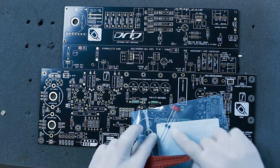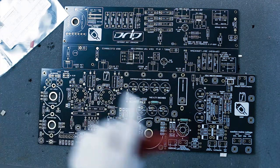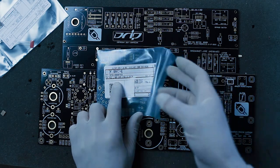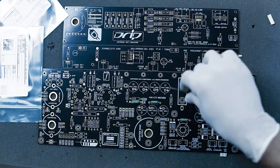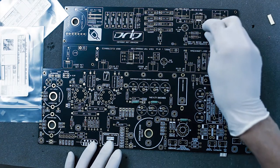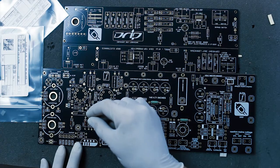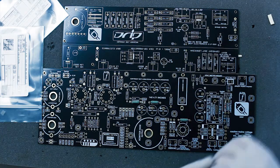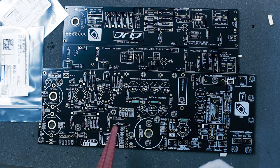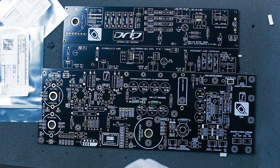I got the diodes but I'm going to use a 6x4 tube. Next item is a 1 meg ohm resistor — we have three 1 meg resistors. One's in the filter, one's in the bottom board, one's R7. The third 1M resistor is right here next to the output transformer — that's a 1-inch lead spread.